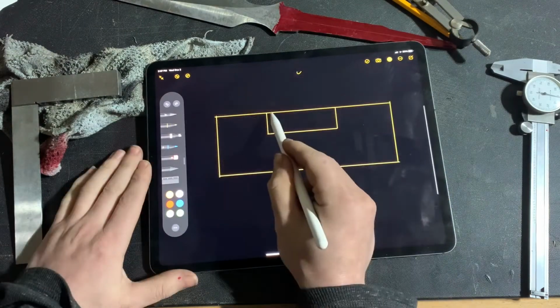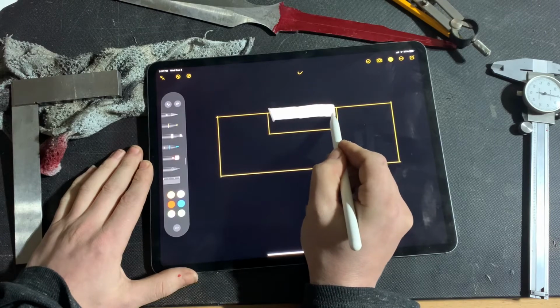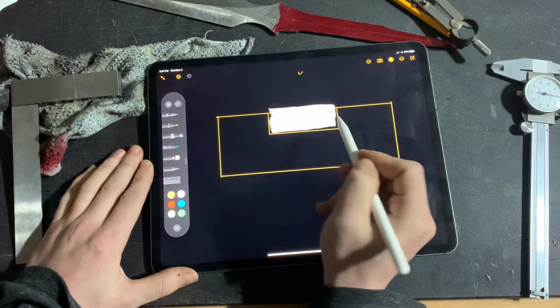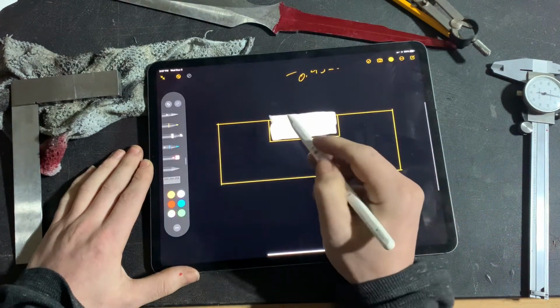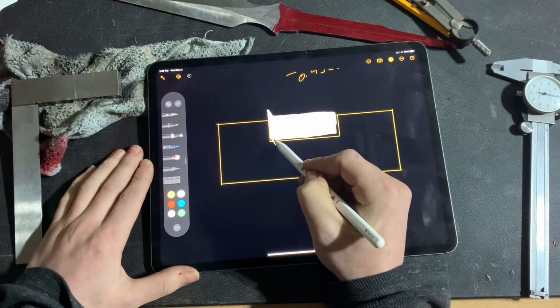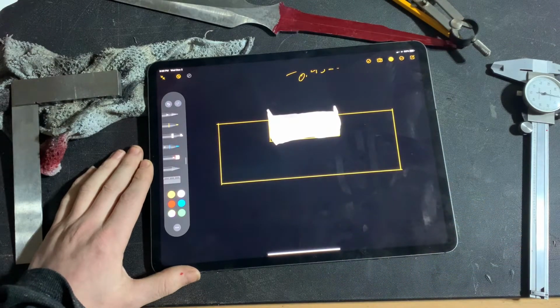An end mill gets plunged into the part and then moved left and right to cut out the material, but it can't do that at full depth. It would bog down and bind up. So you do it in sort of a zigzag pattern, stepping down slightly, but you don't go full width or full depth. Once you get close, the very last cut you do, you go all the way to the left, all the way down to the bottom, all the way to the right, and all the way back out. That will give you a clean, single pass cut that doesn't jam your machine up.